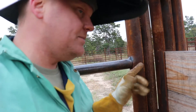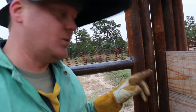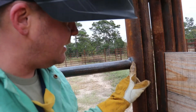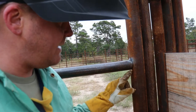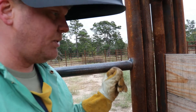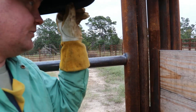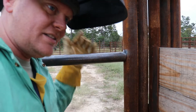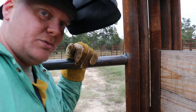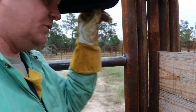There's a gap here and sometimes it's big enough that I can't bridge the gap in one pass. So what I do is I try and fill it as much as I can on the back side and then come back in and mix it back into this guy. This will still burn through quicker than this will. I've got this setting set down pretty far for railing — I thought a Schedule 40 pipe wouldn't burn through so bad, but it'll burn through. Let's see if this works.